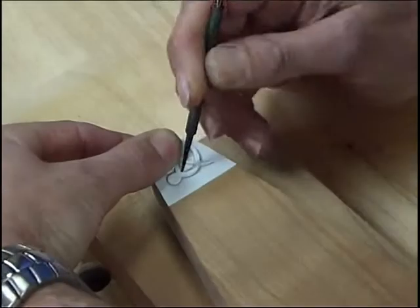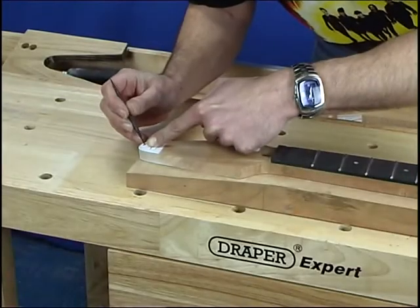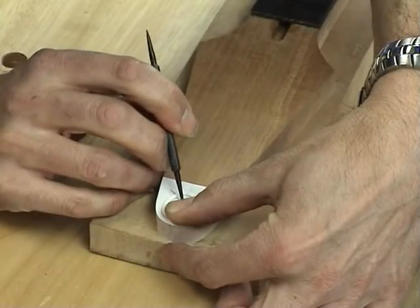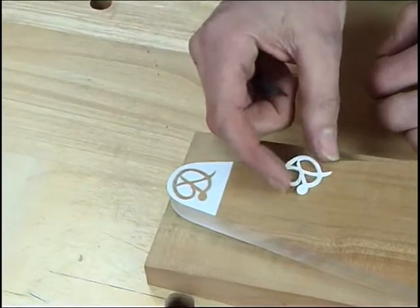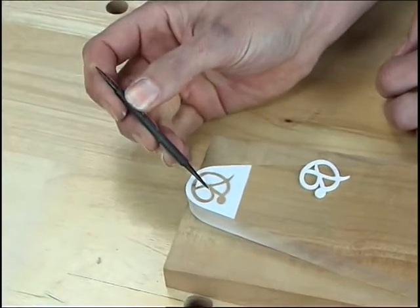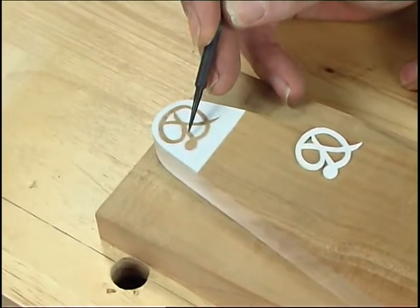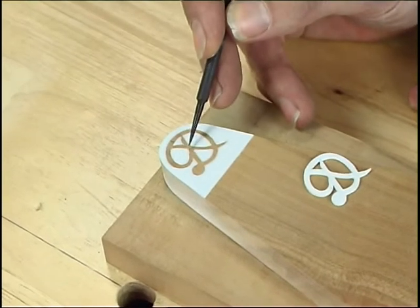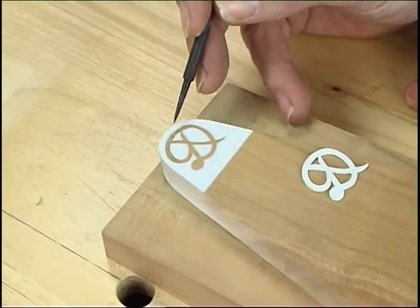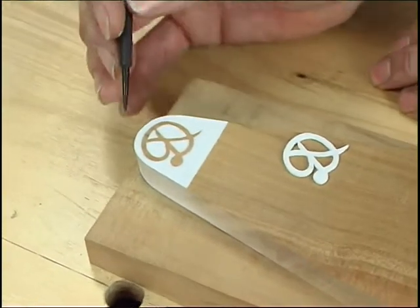Just scribing around gives us a really well-defined edge, because sometimes you get a little bit of overspray that goes underneath the inlay as you take it away. I've scribed around the edges — take it away and you see how much the overspray in certain areas goes under. So where I scribed it here we're going closer to the edge of the inlay so we can route this out properly in the first go; otherwise we'd under-do it, it'd be too tight, and it gets a little bit messy.